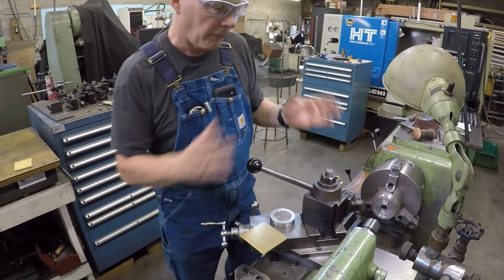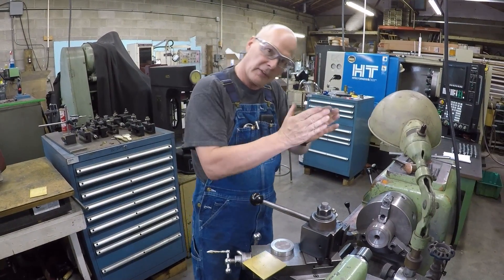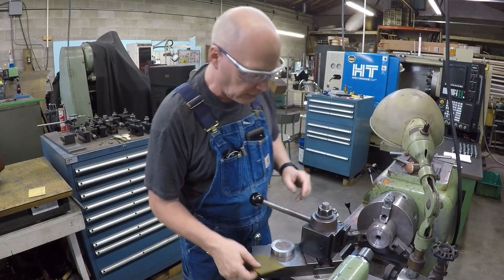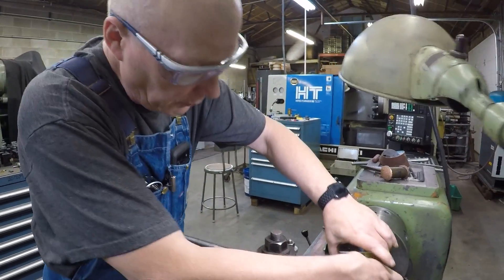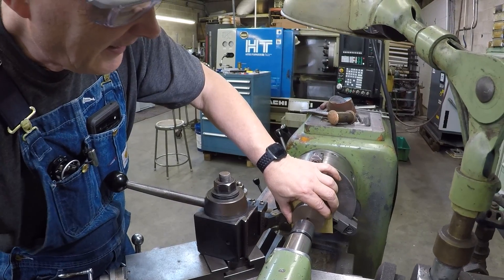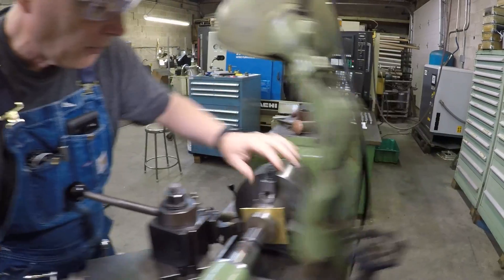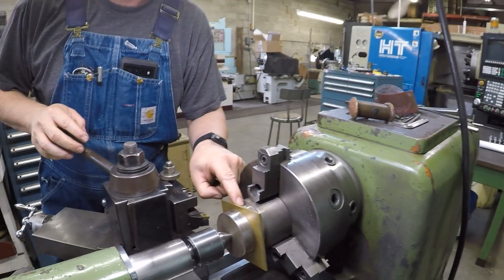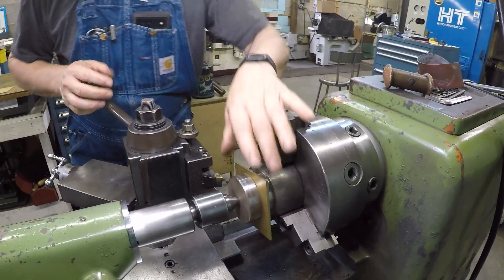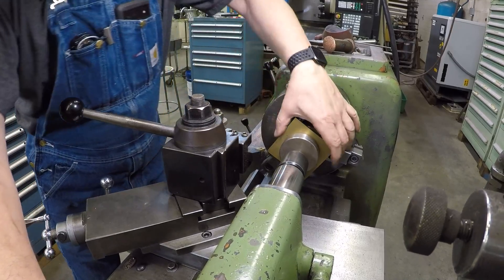The same thing with this cap — you want to machine this in the lathe to make sure it's square, so you don't have it cocked in there. You want it as true as you can get it. The only thing we're going to clamp with is this. If you cut this diameter to the diameter you want to end up at, or slightly under, you get it in here evenly.